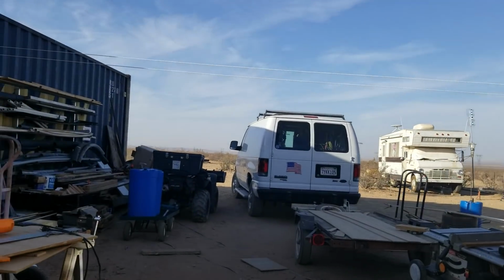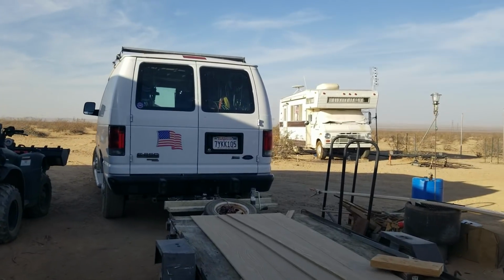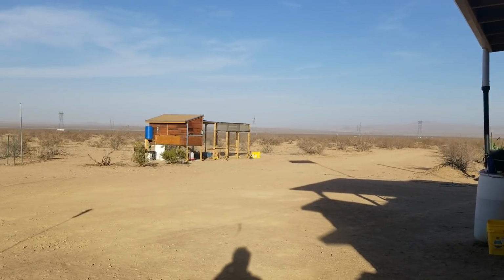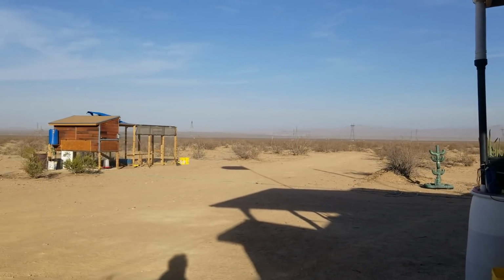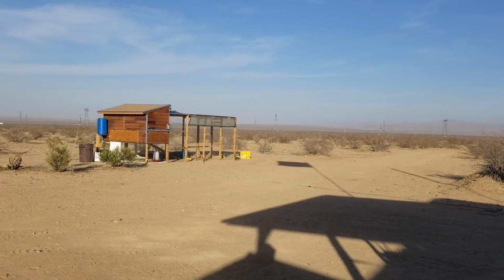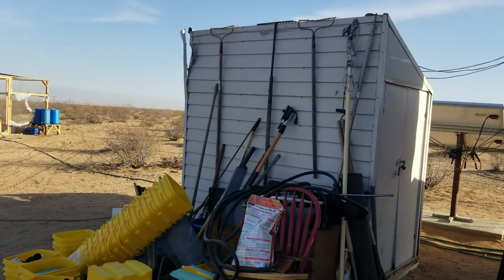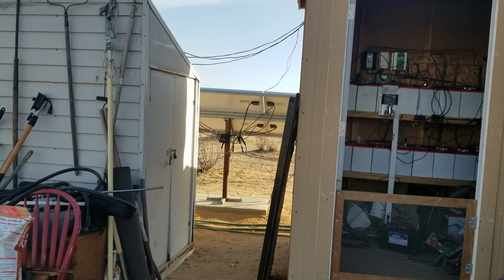All right, now, while I'm walking down to talk about turbines, I had a question about turbines from Forever North Sanctuary. He was wondering which is better, AC or DC turbine. Well, there's a lot of controversy on that. It's kind of a personal preference, but there is one other thing that you have to think about, and that is how far away from your battery banks are you going to put your turbine?